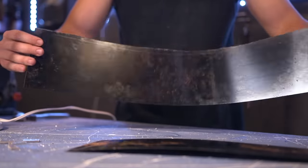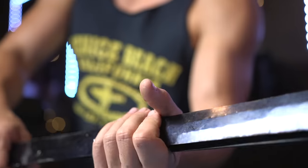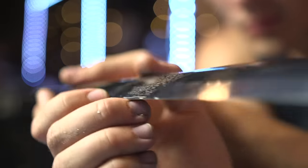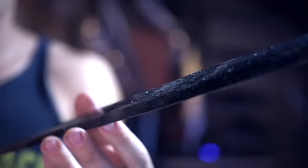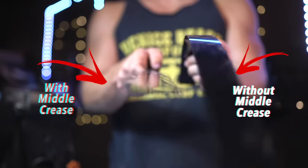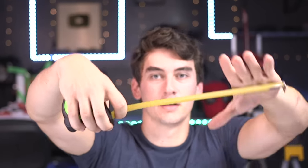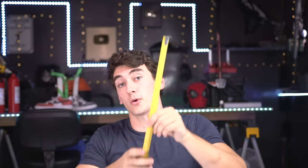A while back I got some spring metal — I think it's actually called blue tempered sheet steel. It's very elastic and also very hard. If we cut a few strips, put a little bend in the middle, and layer a couple strips together, we should end up with a sword that's stiff enough to cut stuff but also bends into a belt. I cut a few strips and put a crease in two of them — there's a clear difference between the creased and straight pieces. Layering one creased piece on top, a straight piece in the middle, and another creased piece on the bottom gives us a nice sword shape with a thin enough edge to cut, but it folds into a belt under enough pressure — just like a tape measure snapping.